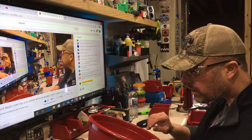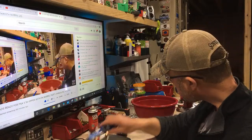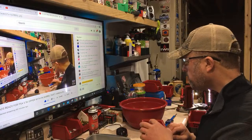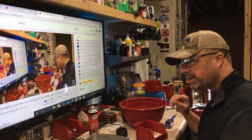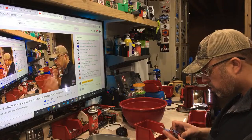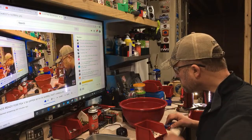And I think this lube has dried enough. And this is going to suck because, like I said, it's once fired out of someone else's firearm, not mine. Most likely a military grade firearm. And the headspace on every single one of these pieces is all over the place. I'm going to try my best to consistently bump this brass. And this piece just needs to get thrown away because it's underneath what I'm going to bump to.